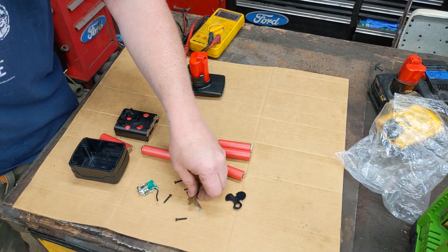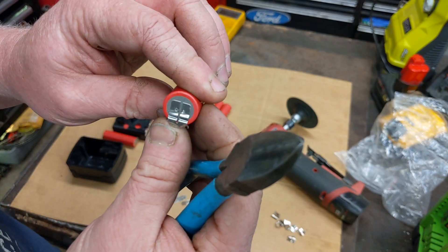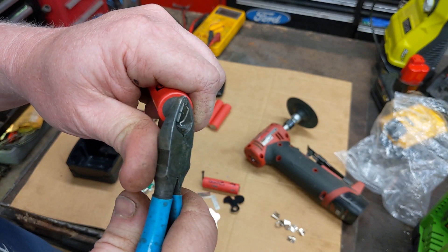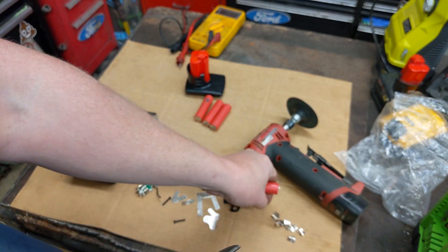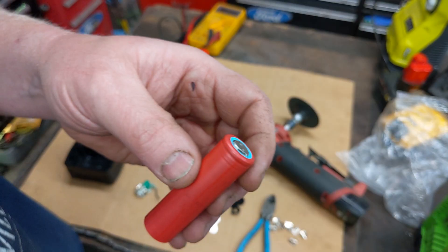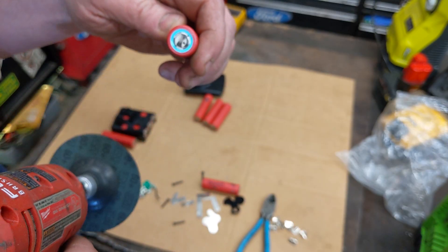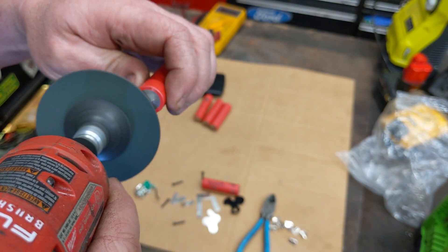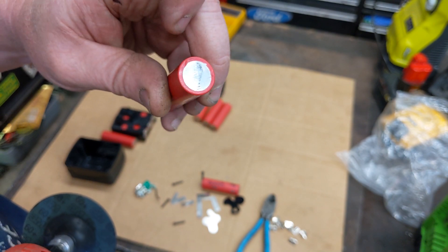We got all the parts and it's as simple as just soldering everything together. Yes, soldering — we don't need to spot weld anything. You can see I still have some of the old tab left in there. I like to cut it first and then peel them off afterwards because if you're not careful sometimes you can rip the bottom of the battery. Then in order to make the solder stick, we just need to sand it really fast to scuff it up — just a little bit, not sanding through the metal.